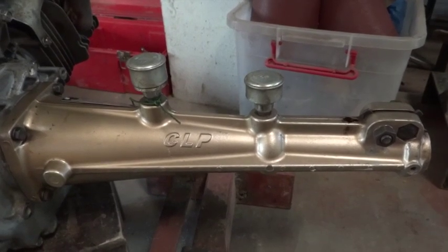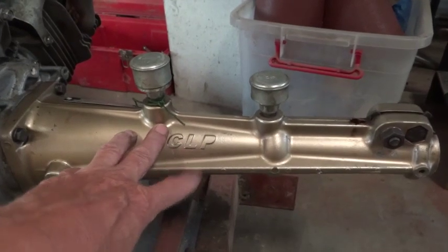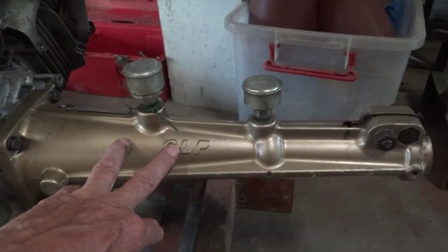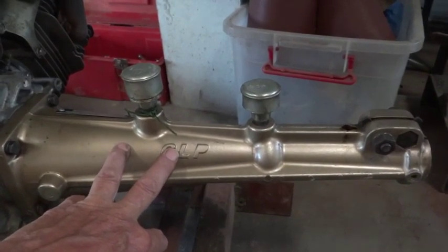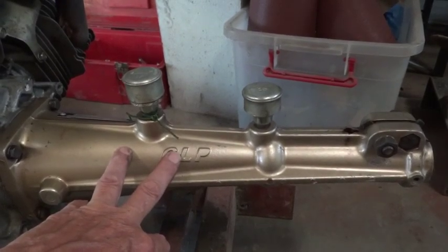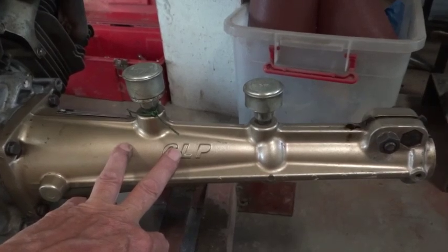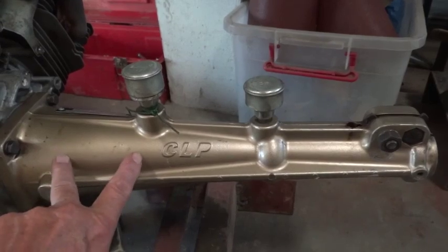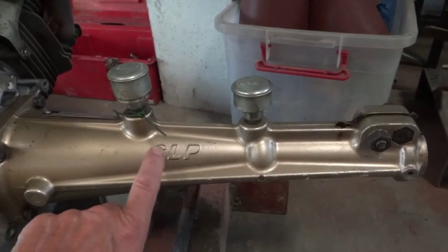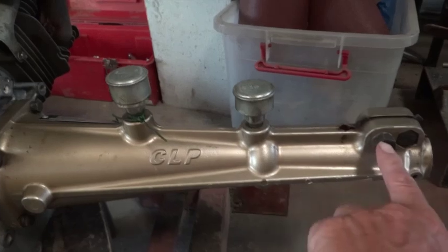If you're going to make one of these yourself, what you've got to consider is you need something like this hub. It can be square — it doesn't really matter what shape, as long as you can use it to hook up to the engine shaft. You might be able to make it out of square material and have it work out fine. You need a piece inside to slide over the engine shaft with a keyway in it, and then you need a roller bearing here — it just rolls, no thrust load on it.